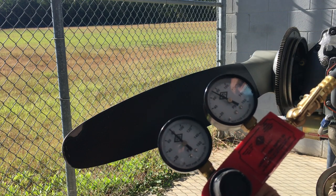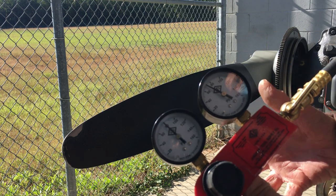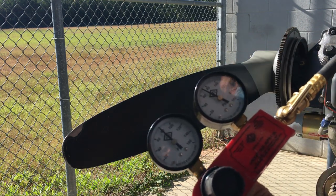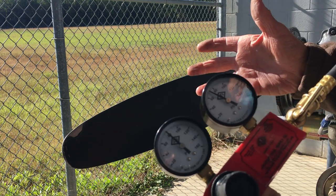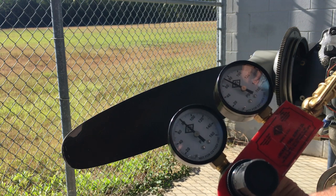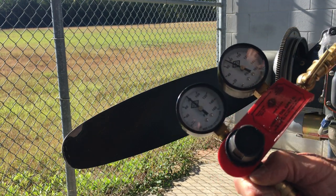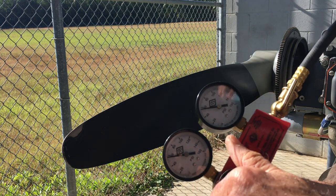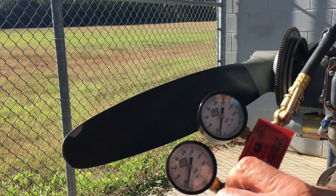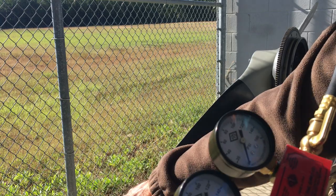So my compression on this cylinder is 70 over 80. Then I go to the manufacturer's information to determine whether this is satisfactory or not for the specific engine. Now that I have the compression on that cylinder, I'm going to relieve this pressure because that makes this propeller safe — now it won't move.